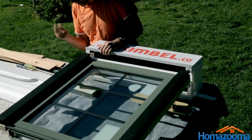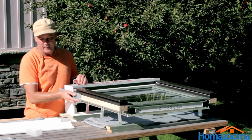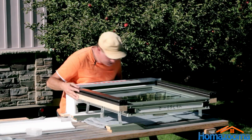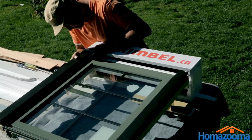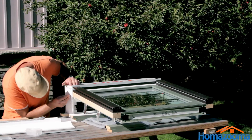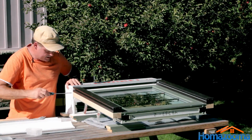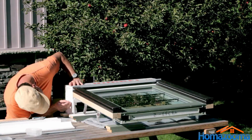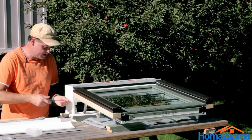So we're just going to slide it in, put in a couple of screws, then we're going to attach this component, put back the styrofoam, the cover, and we're done. So the next step is, let's just attach the shutter mechanism itself. That just slid in beautifully on that side. One screw here. This is a Phillips. Don't over tighten these screws. They don't need to be excessively tightened, just so that they fit snug, and that's it.